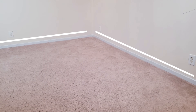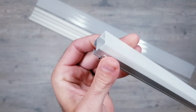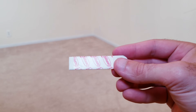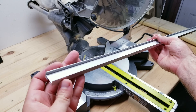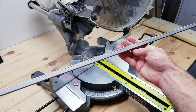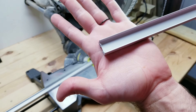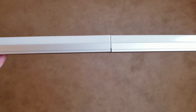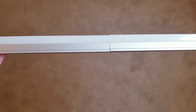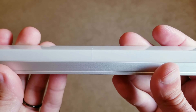I'm going to hang up 10 meters of these channels to see how everything looks using the new strips. For a permanent install I'd use the brackets, but to avoid spackling holes later I'll just use 3M strips to secure the diffusers to the wall. One thing I do to get as seamless a look as possible is to cut the aluminum profile in half using a basic miter saw — though a regular handsaw works too. This staggers the joints so the plastic diffuser covers and the aluminum joints don't all meet at the same spot. What you want is for the plastic diffusers to meet in the middle of the aluminum profile.